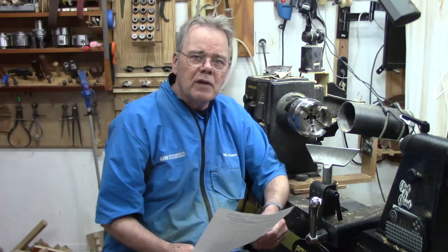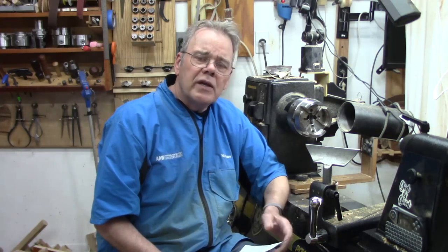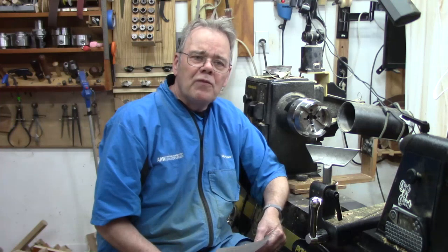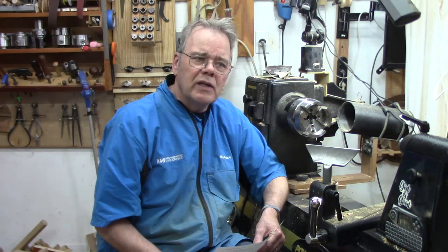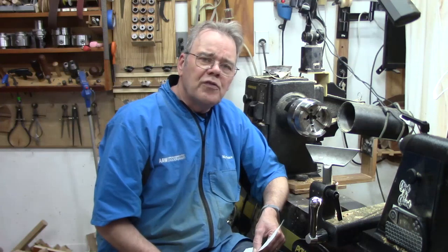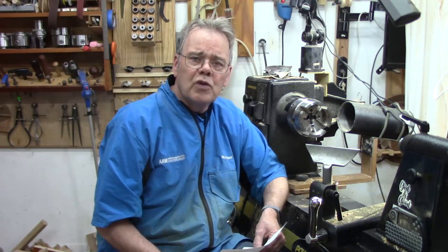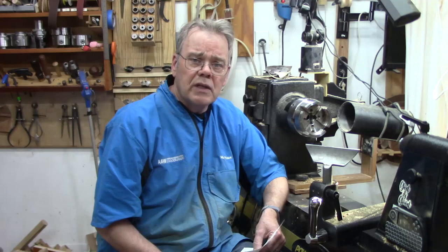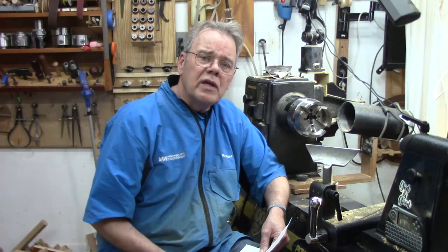It's inconvenient, of course, but inconvenience is not a good reason to avoid doing something safely. I've not had an issue with the lathe unraveling when turning in reverse, and I think for most people it would be hard to make it unravel just from sanding. Number one, you don't want to put that much pressure while sanding — that tends to wear out sandpaper and doesn't give you the best result. My experience is that you're unlikely to put enough pressure on the piece to cause the chuck to unthread. If you've had a chuck unthread while sanding in reverse, please leave a comment below and share that information.